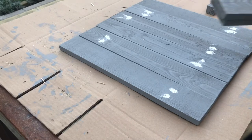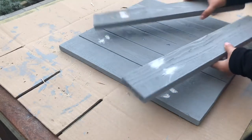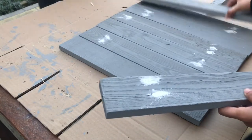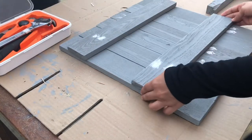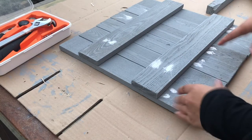Starting on with the building, I laid six pieces of wood side by side and placed two pieces of wood over these in an opposite direction. When we screw these together we will have a base of the table. We screw it from the side — this will be the underside of the table.